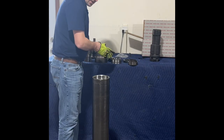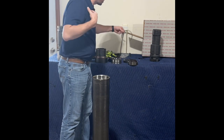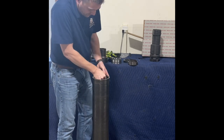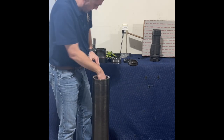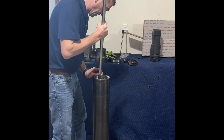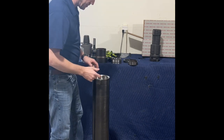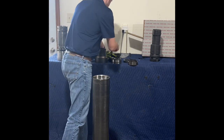We're going to attempt to put together a Rock Hog 6.5 hammer. The first thing we do is build the bottom end — we're going to put this snap ring down in here. It's the first groove you come to; slide that down in there, kick it to the side, it locks in place. The groove location can be measured from the manual, which gives you the location.